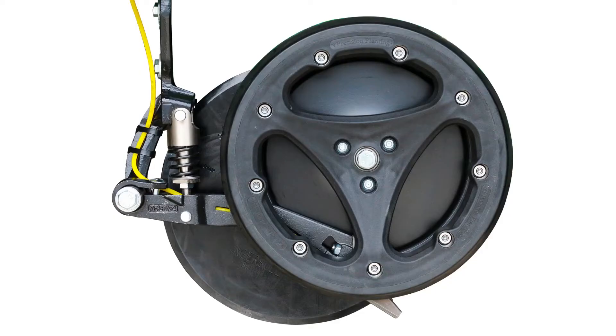Here's a close-up of what it looks like. We've got a spoke-type gauge wheel with a cutout. On the inside of the gauge wheel, we've got an inverted knife — that's what makes a shallow application of nitrogen, typically about an inch and a half deep. The question of the day is: do we run a knife on one side of the corn row, or do we run both gauge wheels for a dual band application?